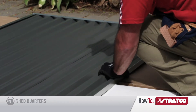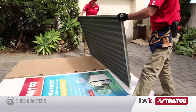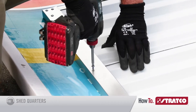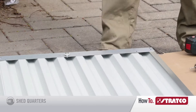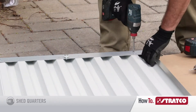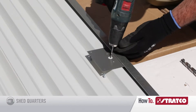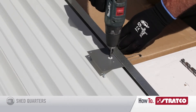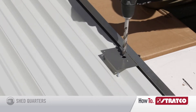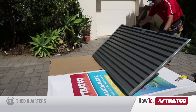Then screw the door plates into the wall sheets. Flip the door over and put screws into the remaining corner holes and in the holes along the top and bottom channels. Drill your first hole using a 9/64th drill bit. Then use the 15/32 drill bit to drill through the hole. Now flip the door back over.